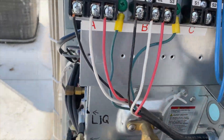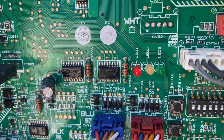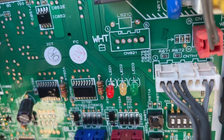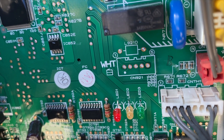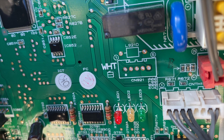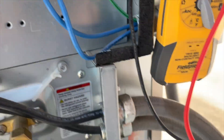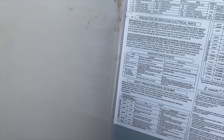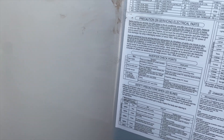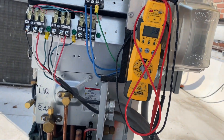We've got our indicator lights here — it's hard to see but the red is solid and the yellow is blinking. One, two — so red solid and two yellows. That translates to outdoor power system abnormality. Don't you just love how specific these error codes are.